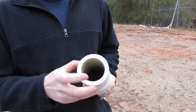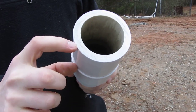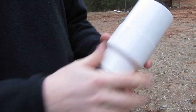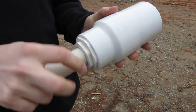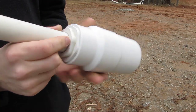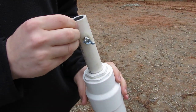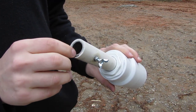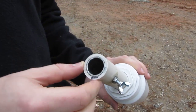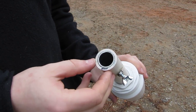It's got SDR-21 for the inner bore and a 2.5 inch outer coupler to sleeve the inside barrel for extra strength. It's got a 2.5 to 1.5 reducing coupler and then a 1.5 to 1 inch PVC reducer. The aluminum tubing is 0.870 inches inner diameter and the outside of that aluminum tubing is 1 inch exact.